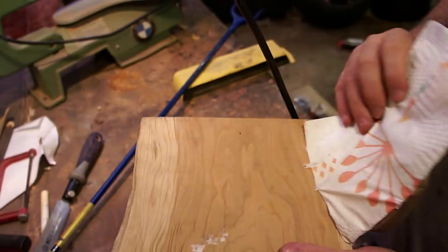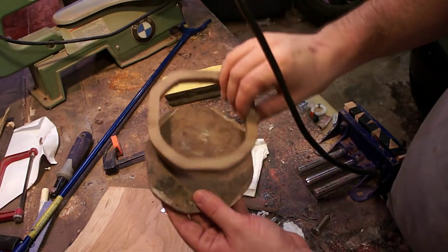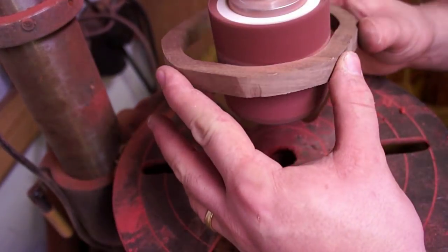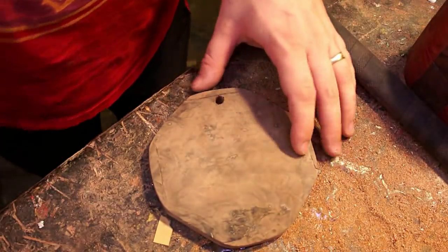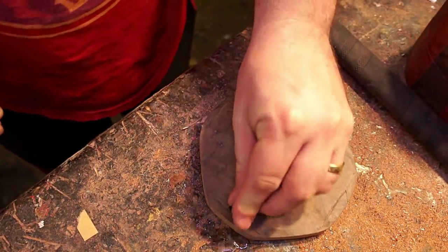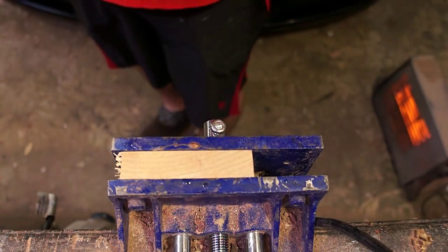Coming back the next day — the veneer is totally dried on the walnut base. I did have to come back and sand and use some razor blades to get all that paper towel off of there. I have to make a quick trip back to the drum sander — if you don't get that inside edge right now it's going to be a bear to sand once it's all glued together. So I had a little bit of a problem here: I already drilled this hole and I had a threaded insert I wanted to get in, but I also wanted to sink it down a little bit so the perimeter edge could lay down flat on it.